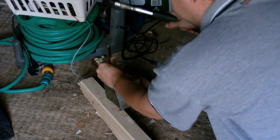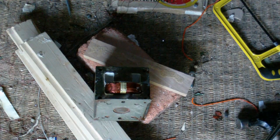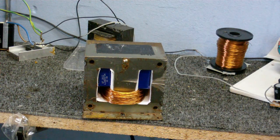Now I'm going to try to bang these secondaries out. It's coming out — one side out. The other side came out a bit quicker than I expected; I was still pounding on it without realising it was out. Now I've got to try to remove the primary and the shunts and then I'll have a transformer core to do whatever I like with. One transformer core. Project is well on the way now.